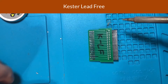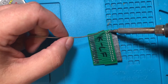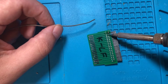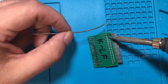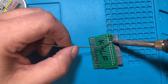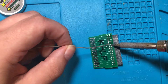Lead-free now. You don't realize until you've used the other two just how thick this lead-free solder is — it's a little ridiculous. It does still have a lot of smoke to it, it melts fine, but it stinks bad. It's a lot goopier — not just because of the quantity of solder, it's just plain goopier. As I'm soldering it's coating the iron with a thick gelatinous solder blob, and it has a lot of flux running down past the second row.